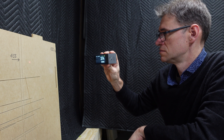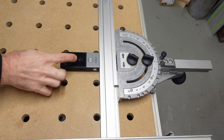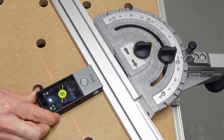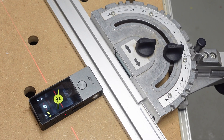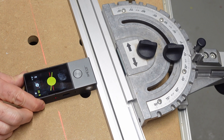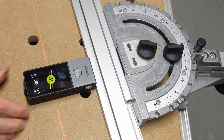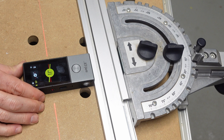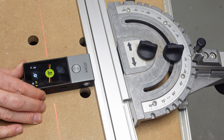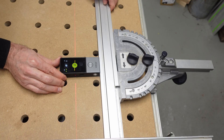Continuous mode lets you measure the distance from the unit to an object or wall with a continuous readout of the distance — that can be quite handy. Live angle display is a bit like using a protractor. First it calibrates a line of zero degrees, and then you can use the laser to mark out an angle from that zero degree line. To test this feature, I'm using the angle adjustment on this MFT table. I found that the angle measurement was accurate when moving from zero to the desired angle, but it's when I tried to fine tune the result that the measurement would start to stray a bit. Accuracy over larger distances might also depend on your ability to keep the D9 Pro steady.